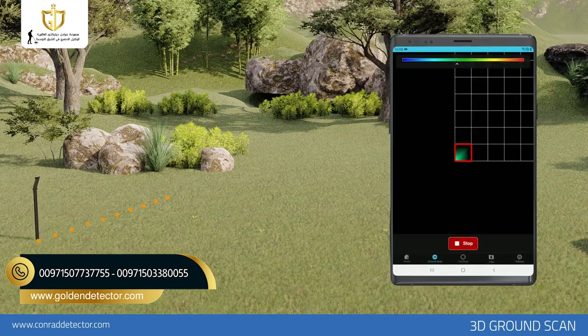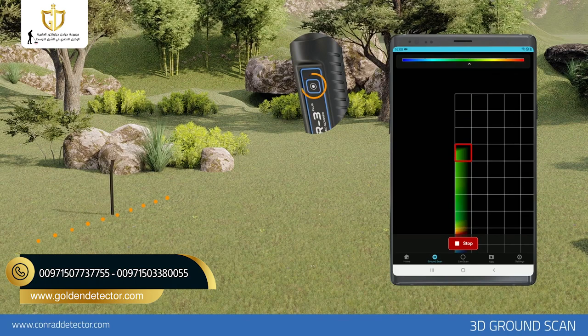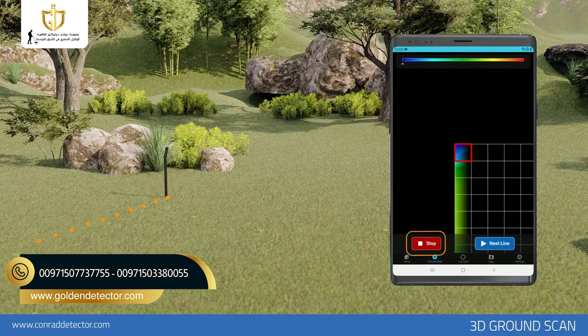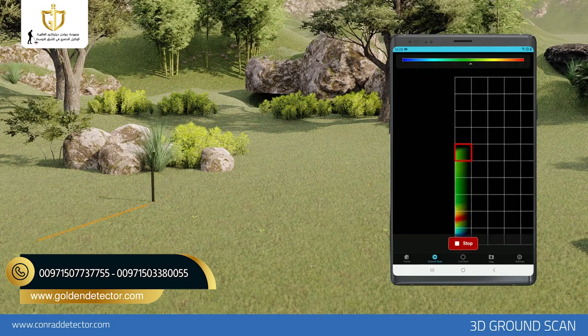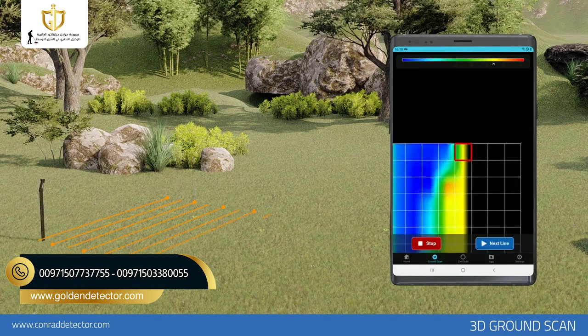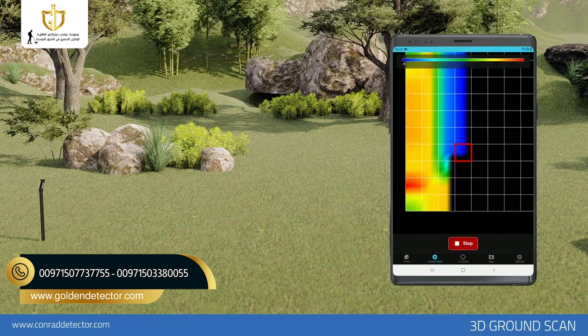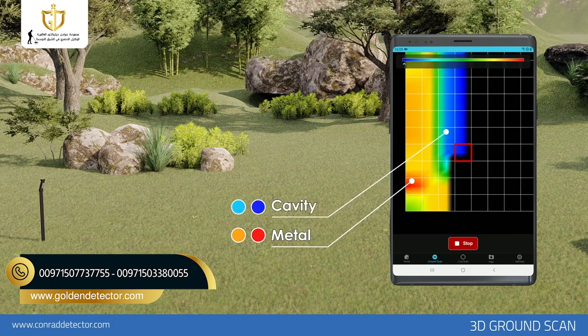In the middle of the scanning screen, you can see the immediate data that you get. If you select Manual Mode, you should tap the Start button on the front handle for each signal step. At the bottom, you can see the Stop icon to stop scanning and the Data icon that is active in manual scans. If you select Automatic Mode, after the signal step count for each row is completed, you will be requested to tap the Start button for each scanning row. The active bar at the top indicates the immediate measurement severity. After you start getting data, you will see colors such as green, red, yellow, and blue. You can see all metallic objects and most objects with high magnetic effect as red, some as orange, cavities and caves underground as blue, and the earth without any anomalies as green.